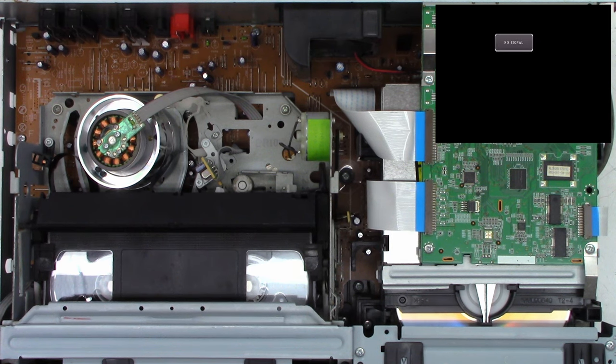And the main thing I want to do is replace that problematic 4700 microfarad 6.3 volt capacitor on the actual power supply board itself. So here is the power supply board. On some of these, you want to take a look and just look at the capacitors, make sure none of them are bulged. I've had a rare occasion of one of these bulging, and maybe that one right there. Mainly it's this filter cap right there, which is, like I said, the 4700 microfarad 6.3 volt cap that typically fails. I always replace them.